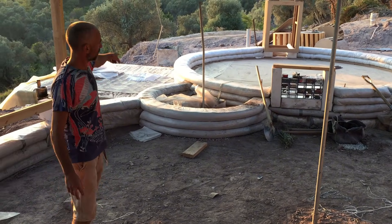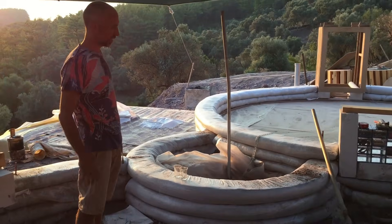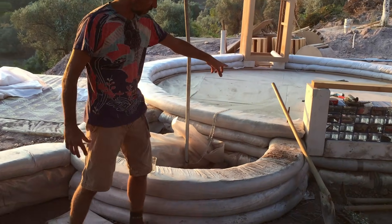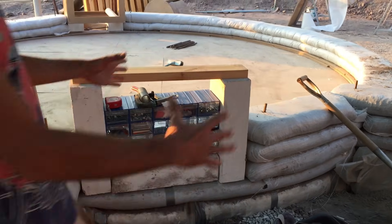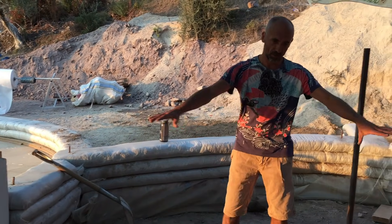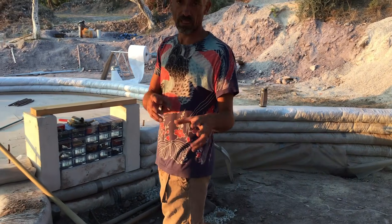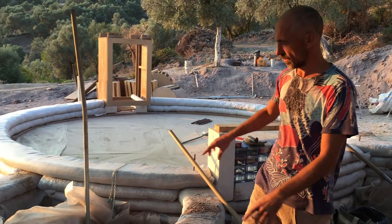It's really nice — we connected the two. We started lifting and connecting these two structures together, which was really important because you start to see exactly how these pieces are interrelating. And then with the fireplace, we connected it in here as the buttress also. Use your buttresses creatively — this one is going to come and we're gonna extend it a little bit with a countertop for like a peninsula. Get creative with buttresses, because they are one thing about superadobe that can seem to get in the way a little bit, so just find creative ways to use them.